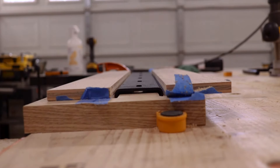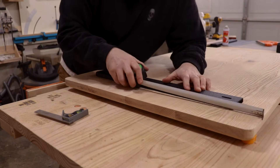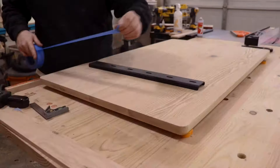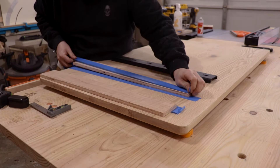As you can see, I got the fit just right. Now I'm going to set up my actual piece on the tabletop and strike a line so I know exactly where that will be. I'm going to make it just a little bit proud of that because you want to allow for wood movement when installing these channels.